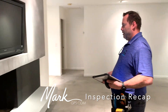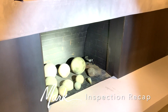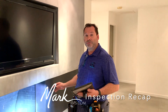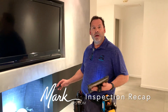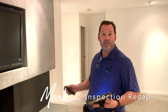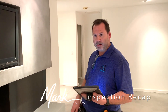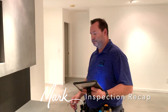Back inside at the living room fireplace: it doesn't have ember screening or a glass panel to stop someone from reaching in. More importantly, there's no gas key on the exterior of the firebox — the only shutoff is located inside the firebox itself, which is not to code. There needs to be a key on the exterior side. It's wood-burning and/or gas, and has a spark arrestor around the chimney. The damper also does not have a clamp to keep it ajar when the gas is in use — right now it's closed all the way. There's a key for that accessible via a closet nearby.